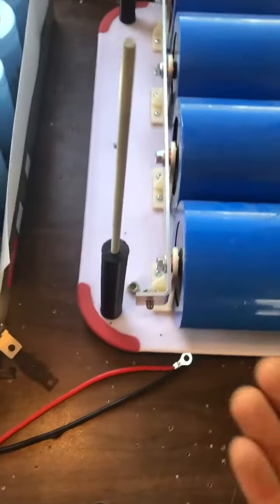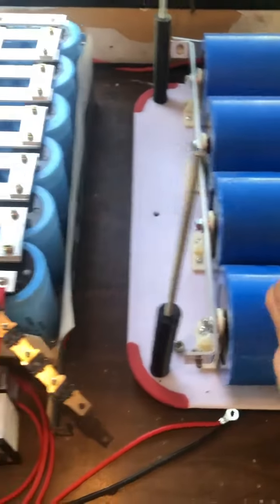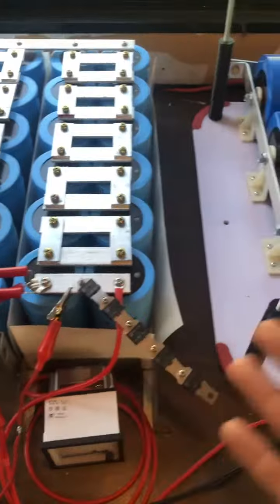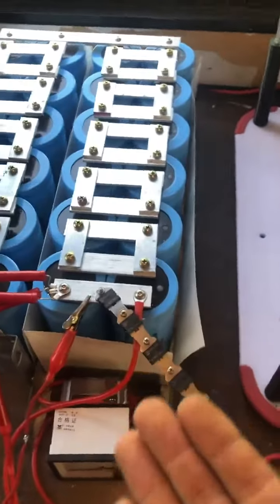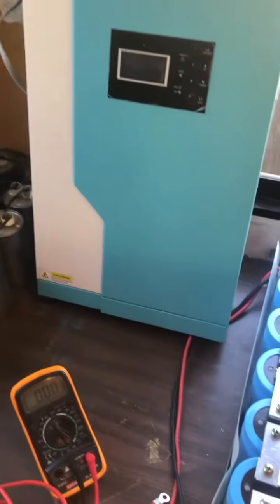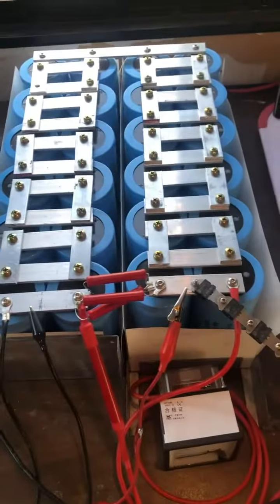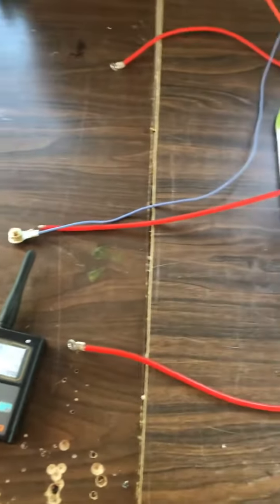Once it's in resonance and operating, we could use that smaller cap I showed you with the right capacitance to cause a transformer action between this capacity and that one. In that process, if we reduce it four times in voltage, we're going to increase our amps four times in resonance. Then we rectify directly into something like that or this. So we're going to attempt to match some resistance next and plug a cap on there. Ciao.